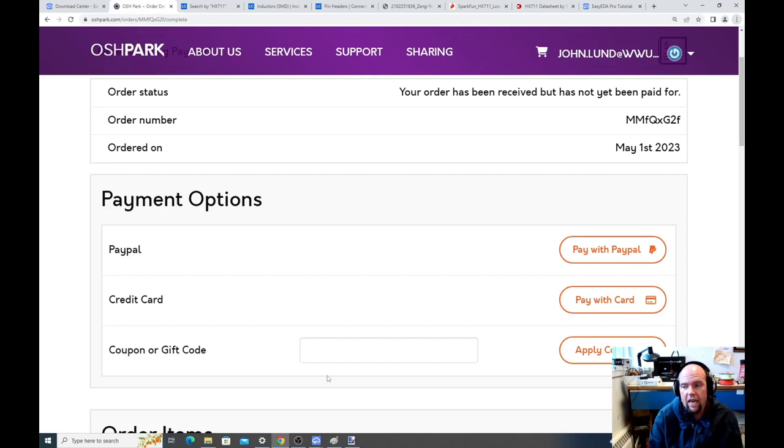It should have your name somewhere. The rules are the file format has to be what we specified, millimeters, the color you want, the number, do you want 5 or 10? And then your name has to be somewhere on the PCB itself. It has to be visible. Make sure it's visible in the verification. And then you're good to go.